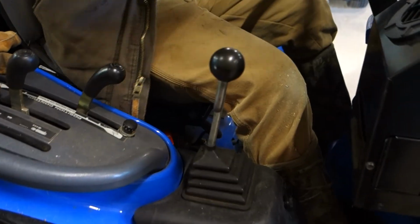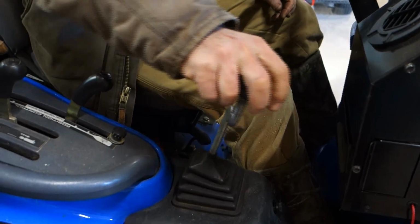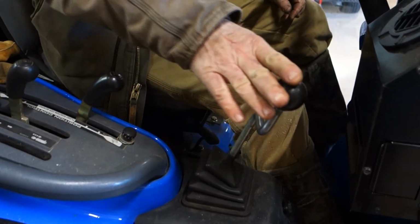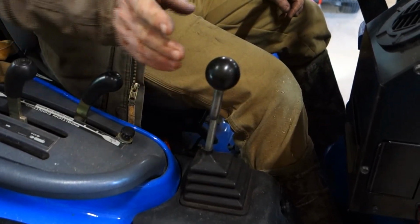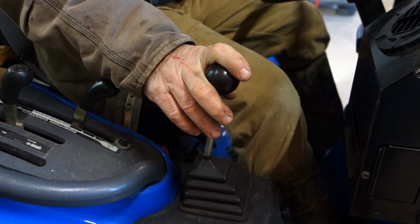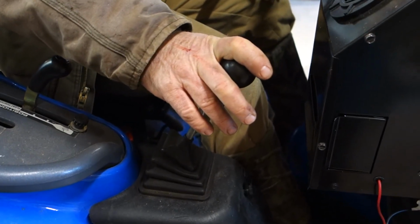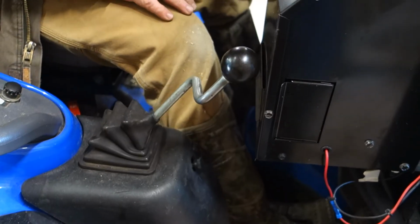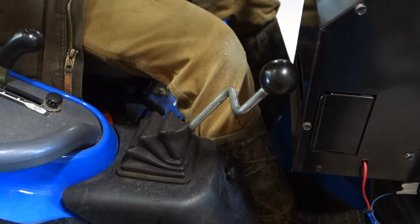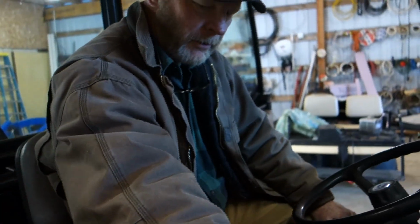Anyway, this is the controller. There's the control lever for all the things on there. Okay, up and down. That's down. That's up and down. When you're going forward, actively blowing, you push it forward and lock it in the forward position because that'll float it. Otherwise, you're going to dig. It's fixed. That gives you your float. So anyway, that's where you put that when you're running.